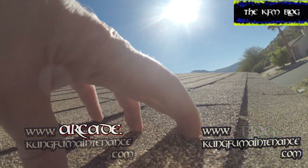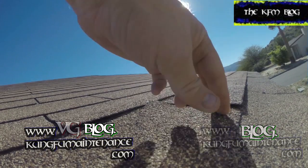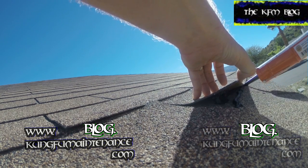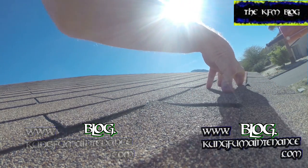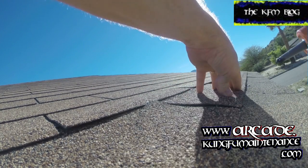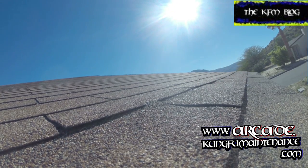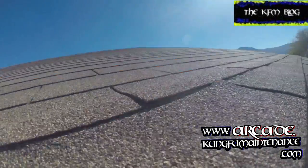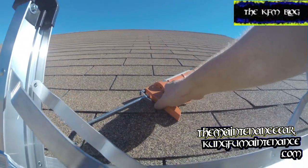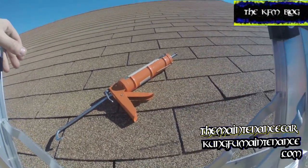That's really all there is to it, just getting up there and putting some cement underneath there, pressing it on down, and again as it gets hotter and warmer, the tile will start to stick down a little bit better. That'll basically go along the whole edge and check for any loose ones, fix them up. Better now than in the blazing summer, but that's how it's done.